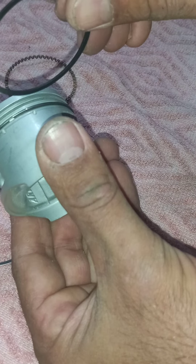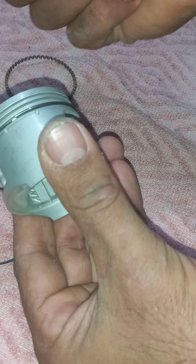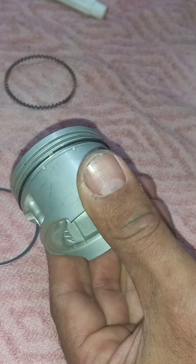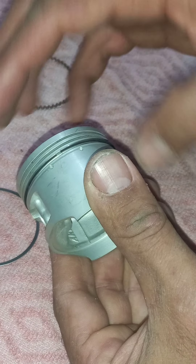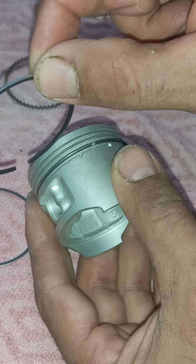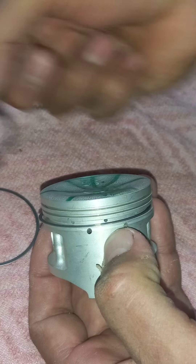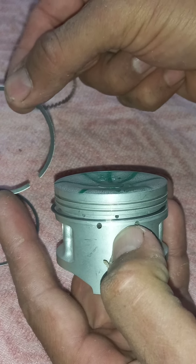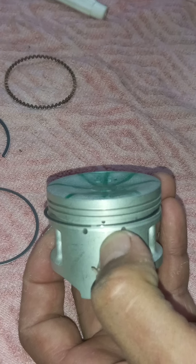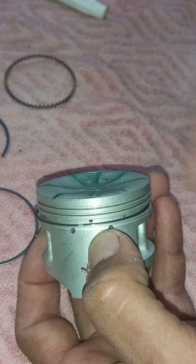Now I check the second one — clearly. If both of them enter here, it means they are the same size. You have a caliper, you can measure it. Because this has a stamp and this doesn't have a stamp — this is the second ring and this is the top. The mark is only on the top. If both have a mark, the manual book should tell you which is on the upper side and which is below.